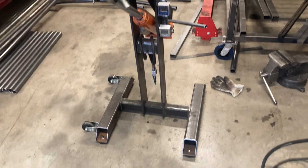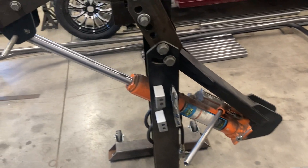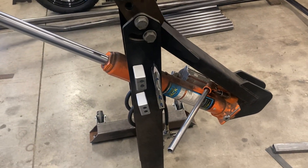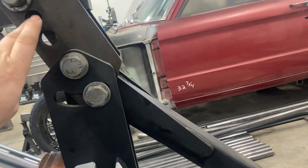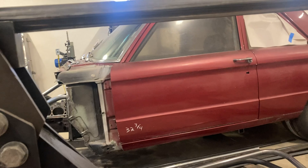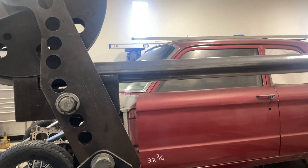You can see it's just got a pretty basic little frame. I drew up all these parts and had them plasma cut on a CNC table. It uses a Harbor Freight engine hoist jack — this is an air powered one. I'm just running it with the jack handle right now because I don't have my air compressor running. A cool feature I haven't seen other people do when they build these style stands is I put this slot here. This 2x3 tubing that holds the jack does not have slotted holes, so it's basically indexed with the bender itself. If you loosen these two bolts, you can level this tube. You put it in the bender, get a little bit of tension on it so it's tight, and then basically level it out. It just helps a little bit with keeping your mind wrapped around the angles.